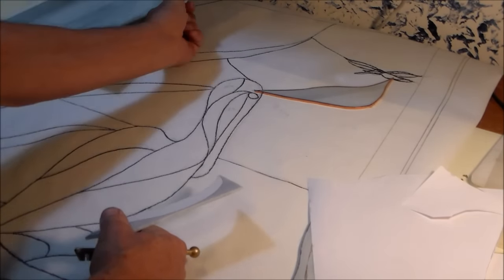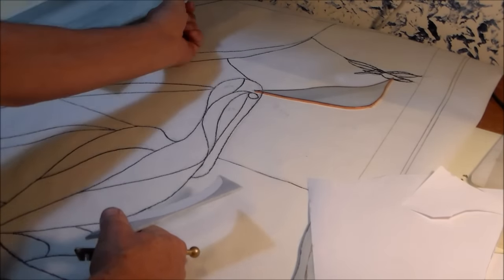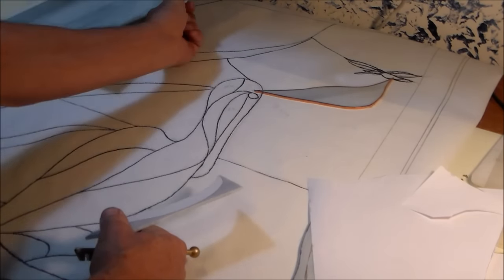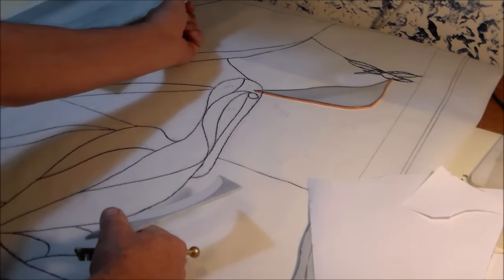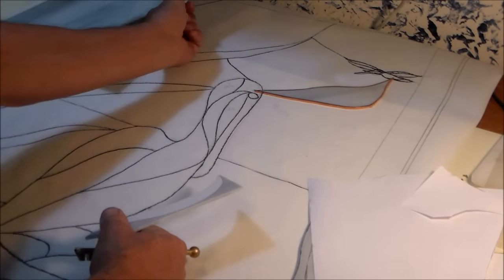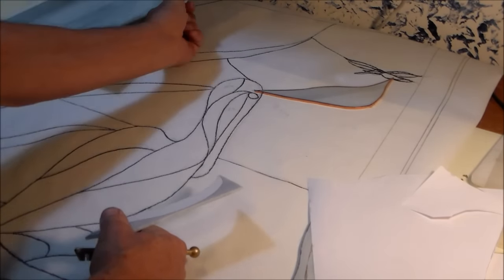Okay, now that's ready to solder. For fine detail work you can use a dremel with a diamond tip grinding blade — you can even grind a hole through the glass, like I did for the eye on the alligator head.